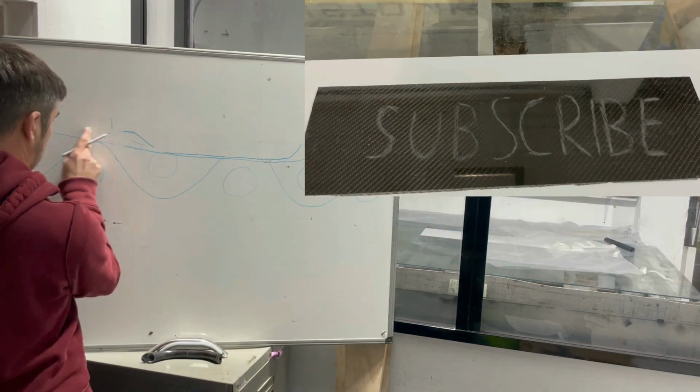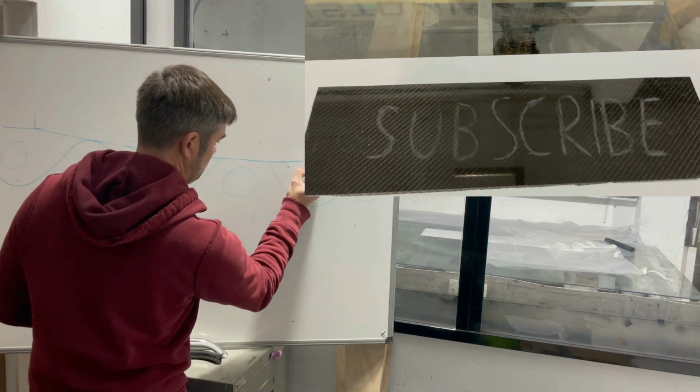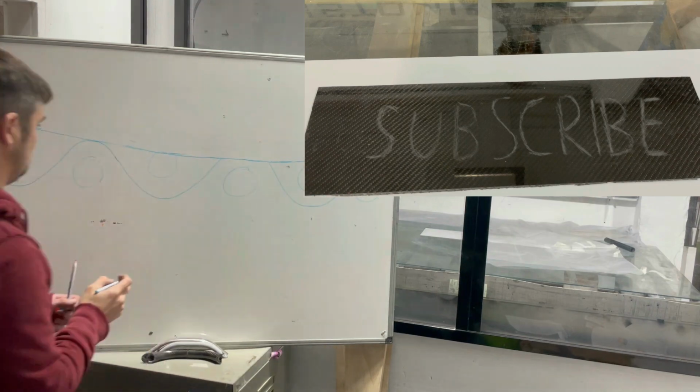So as we start moving to finer sandpaper, we extend the area that we're sanding to help smooth it all out. Now this really is tedious, and I think is one of the worst jobs in composites, but it is a skill and it's very much a test of patience, so let's get sanding.